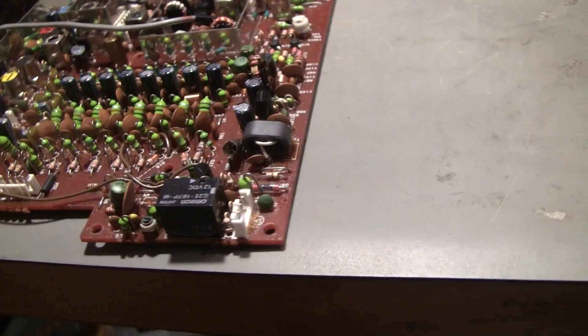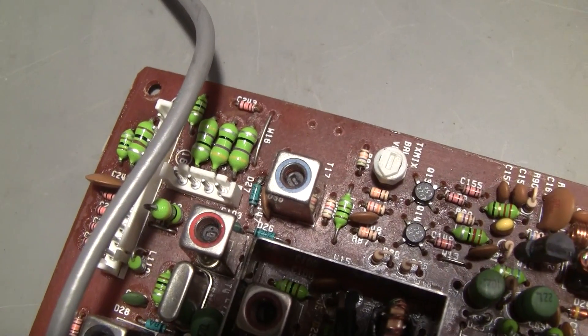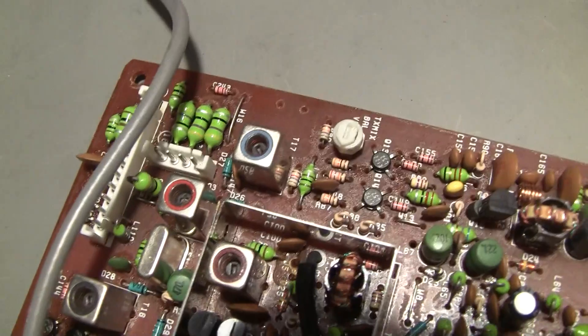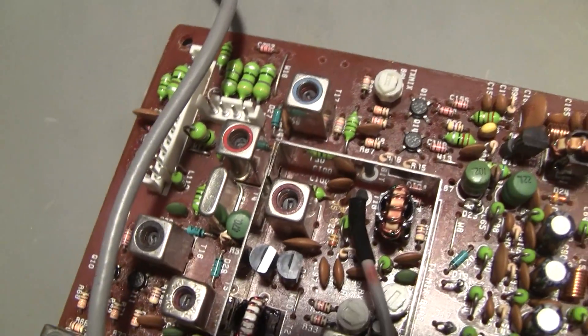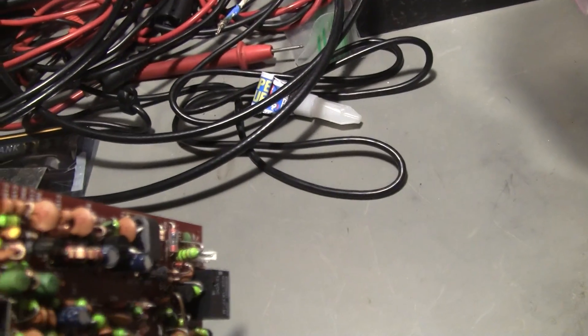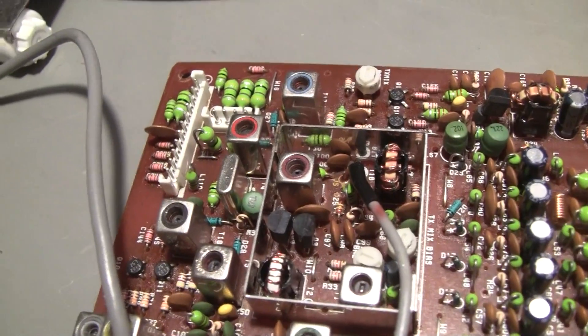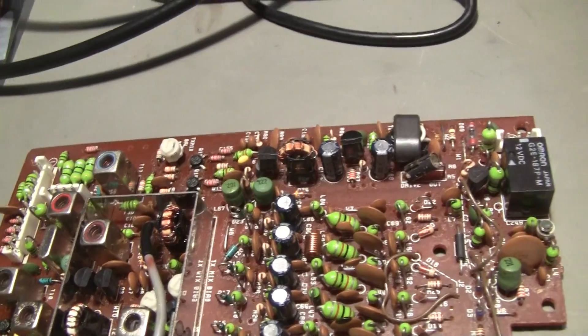The issue was right here. There's two pairs of diodes here — you see those two blue diodes? There's two there and two right there in the center of the frame. The problem is the signal stopped basically at the end of one of these pairs of diodes. My scope wasn't picking anything up at what I think is 45.2 MHz — the crystal frequency. There's just so much bad solder in these units, it's not worth trying to troubleshoot until I've fixed all the solder. We'll see if that brings the crystal back.